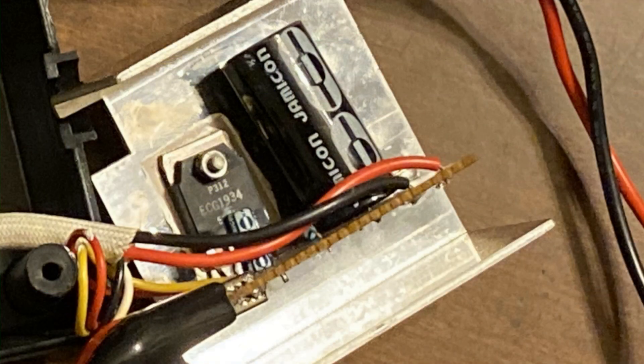Let's take a look at the actual power supply hardware. The existing voltage regulator circuit is mounted on a single PCB, which sits in a metal enclosure. The existing NTE 1934 regulator is bolted to this enclosure. The metal enclosure is acting as what is called a heat sink. The byproduct of the voltage conversion in the voltage regulator is heat. The regulator gets quite hot as it does its job, and without a heat sink, its ability to convert voltage drops significantly. The regulator will fold back its voltage as a means of overdraw protection if its temperature rises too high. If you've ever noticed how a wall wart power supply feels warm to the touch, or have wondered why computer power supplies need cooling fans, voltage regulation generates heat and is the reason. The white material behind the NTE 1934 is thermal compound that helps conduct heat from the regulator to the metal it is attached to.